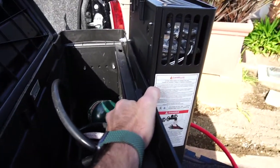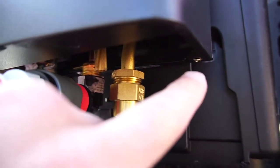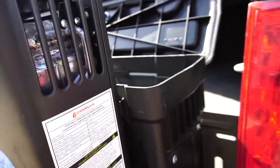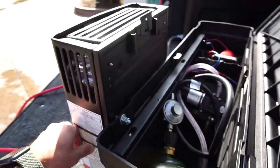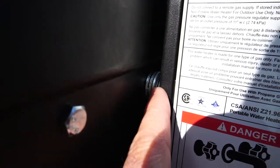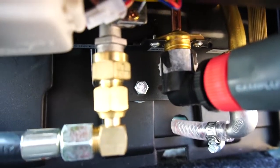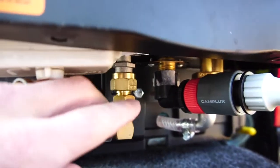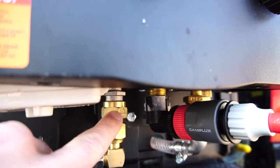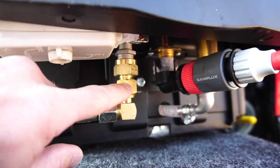I had to take off the screws from the cover, including a couple underneath, and then drilled my bolts through the casing on the actual water heater itself. On the top there are two bolts spaced with washers, and on the bottom another bolt with washers. I actually broke a gas valve trying to change a piece — don't try to take it off. Follow the instructions, use the tools that came with the system.